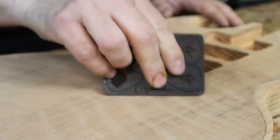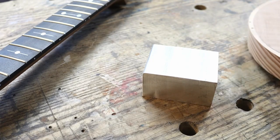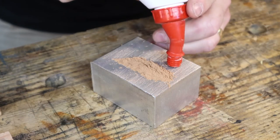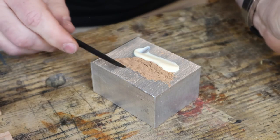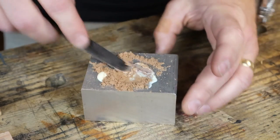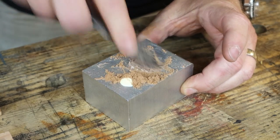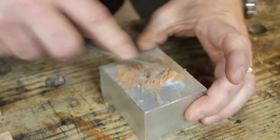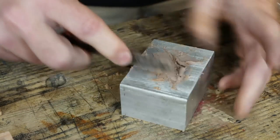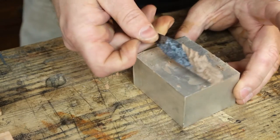I can't find my glue spreader, so. I don't want to ruin this with glue, actually. Palette knife. Using white glue and dust gets something a closer color to the dust than you would achieve using super glue and dust. And what you want is almost dry custom wood filler, essentially. I've got a block of titanium somewhere, probably at the home workshop, that I can't machine for love nor money, but I'm thinking that would actually make a really cool glue spreading thing. But that's the texture you're after.